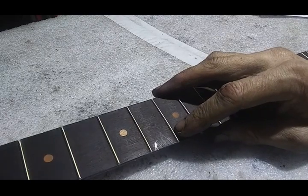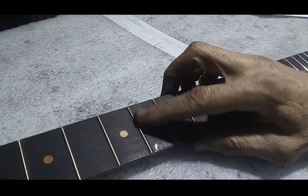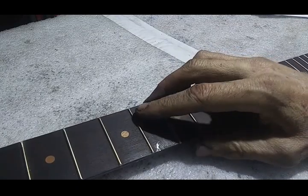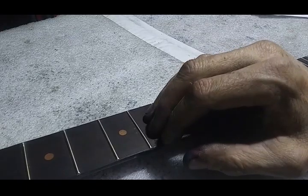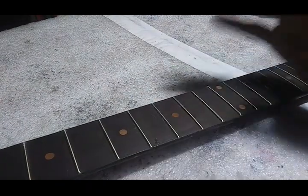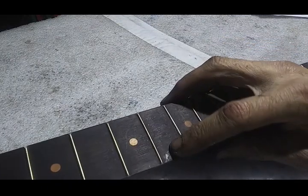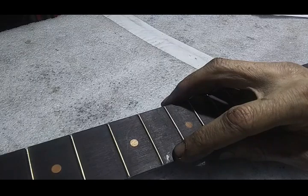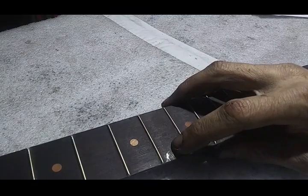Now, I've heard that you can use a razor blade and scrape, but my concern is that I've used sandpaper to sand, and whichever one you sand looks different from the rest, unless you sand them all the same. And so I used to end up sanding entire fretboards a whole lot. Now, just hitting this with a little lacquer thinner should do the trick, but then we have to add lacquer thinner to the list of supplies.